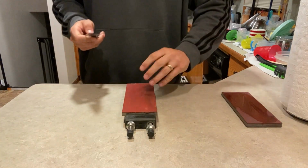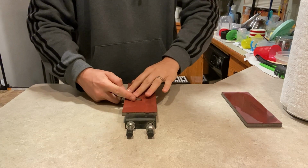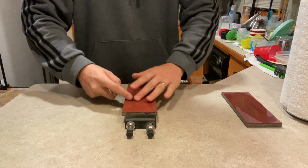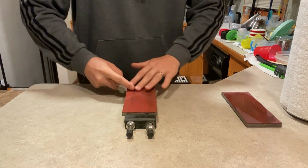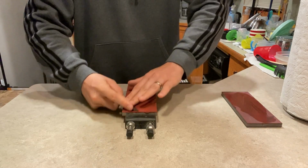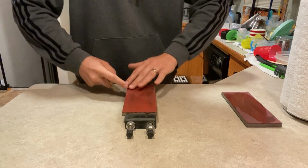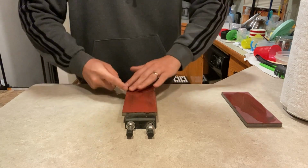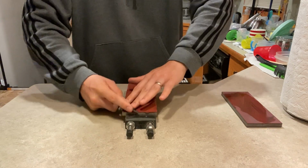All right, this is the 12 Hundo F, which is 2 to 3 micron. So nice high finish. Not looking to do a whole bunch of work here. The burr was much smaller off of that 800 too, by the way, compared to the 2 coarser stones. Less time, less pressure, and just different stone grit-wise.